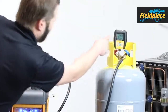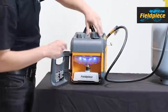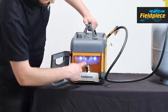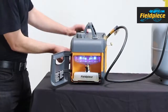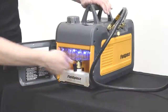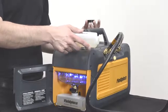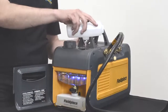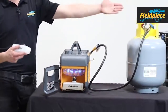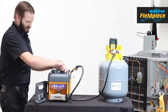You'll notice I'm at about 5,500 microns right now, pulling down that whole tank. We're going to drain the oil without losing many microns. I flip the switch to start draining — it takes about 10 seconds to get out of that compartment. I have my new oil all set up ready to go. Once it's done, just close the valve and dump the new oil right in. You'll notice there was no noise change when you change the oil — it runs smooth. It can actually run for several minutes without an oil change, but you're better off doing it as quickly as possible to avoid losing microns.